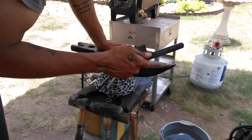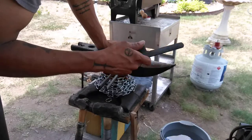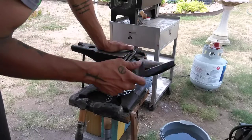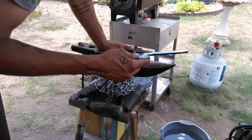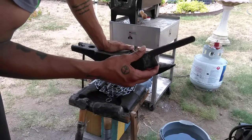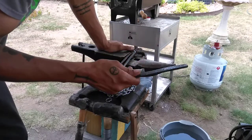If you've ever worked with 5160 or just a hypoeutectoid steel, you know that after you're in and out of the forge a few times, just trying to normalize the steel really doesn't get it soft enough to drill through easily. I've burnt up a few bits on this.